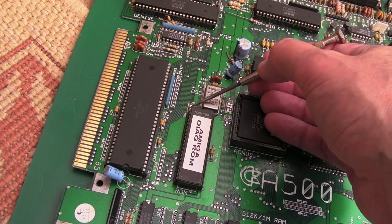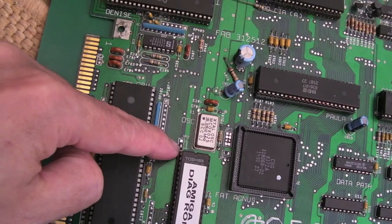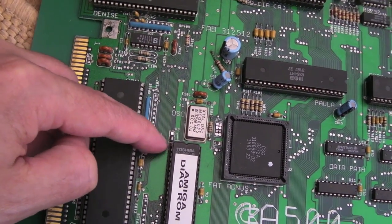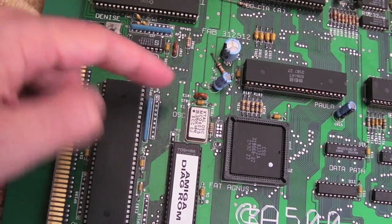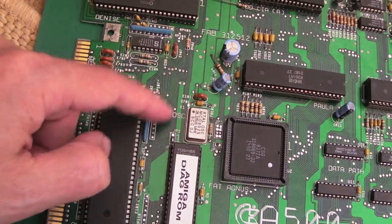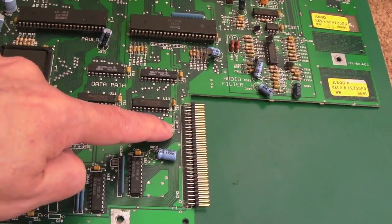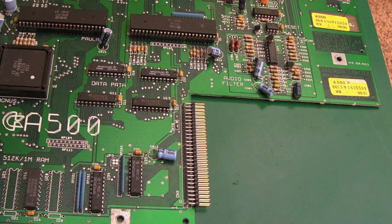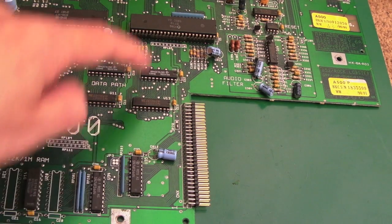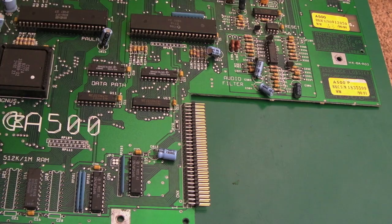There are a few things to mention while we're on this part of the repair series. Jumper 2 - I had to resolder that, it was set correctly but was actually just completely open circuit. I presume someone had a wire on there because there is a mod you can do - I forget what it is exactly, but it's related to the control of this ROM here. There's another jumper down here that was set correctly as well - 7A. As well as fixing those slightly damaged traces up there - one was definitely a break - I managed to trail some solder across to repair it.